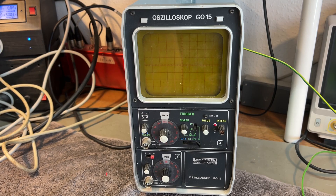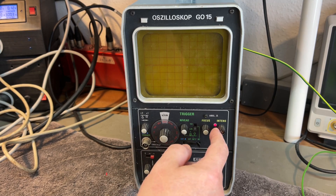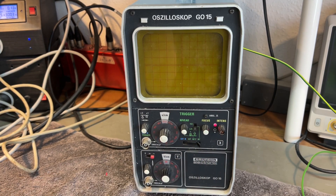Here at 100 volts it is only using 9 watts, so everything is perfectly fine. We've got a lamp here — let's just continue. At 150 volts, 20 watts. There is nothing that scares me here, so let's just go all the way to 220.